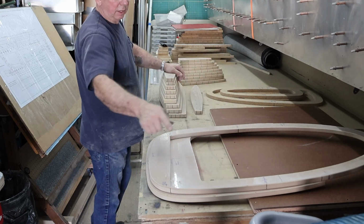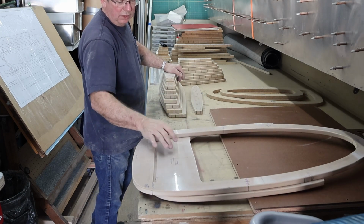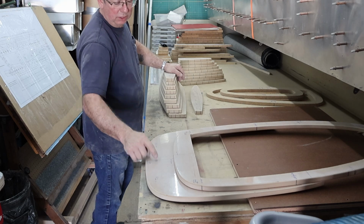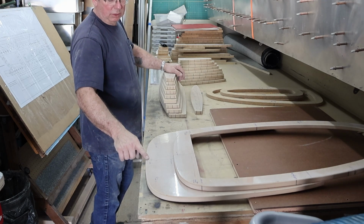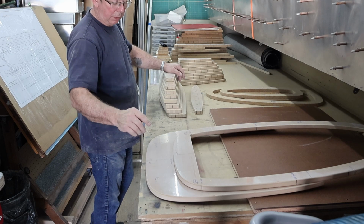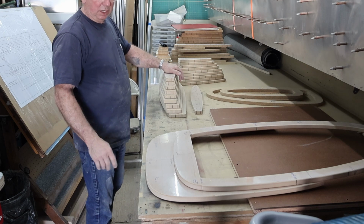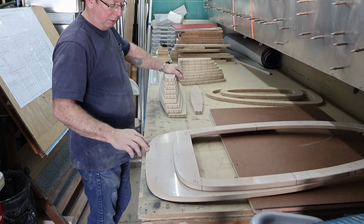Here, and up there, I think, on both sides, and then here, and one in the center there, one on each side, and then we've got a 3/8 diameter hole here that I'm not too concerned about, although I will go ahead and pilot that so it's done with when I set the blank up, and then I'll open it up to final dimensions once everything's formed.